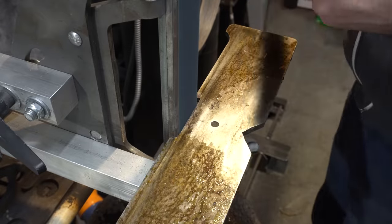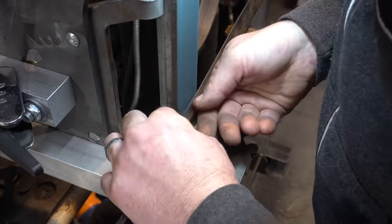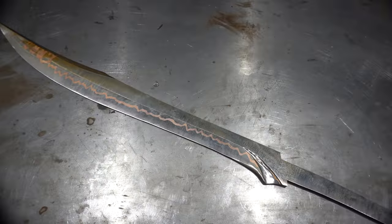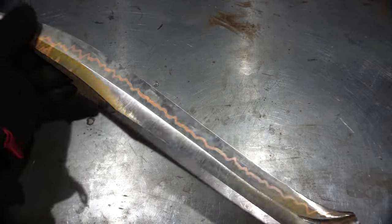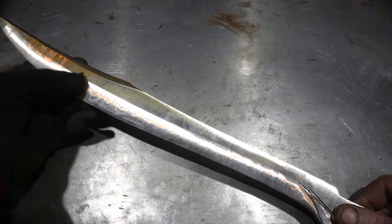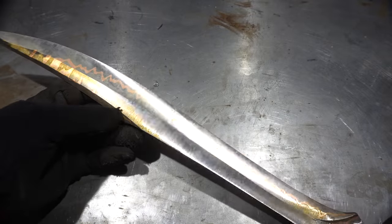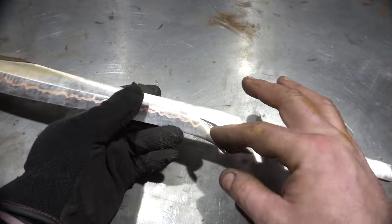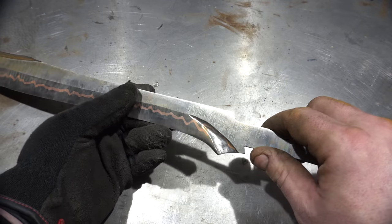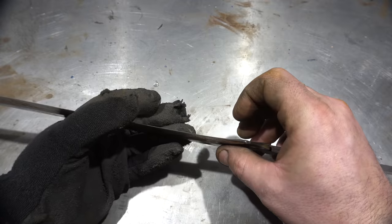This was certainly a tough blade to grind, one of the tougher ones I've done in a while. Just with the shape of it, it was hard to get those bevels to not have facets in them. Here it is after final grinding — it's still a little rough. I did the bevel on 120 grit, but it just means I'm going to have a lot of hand sanding. I fixed these so that they end right at the bevel, which is what I wanted. These are tough to put in and get right, but I like them.